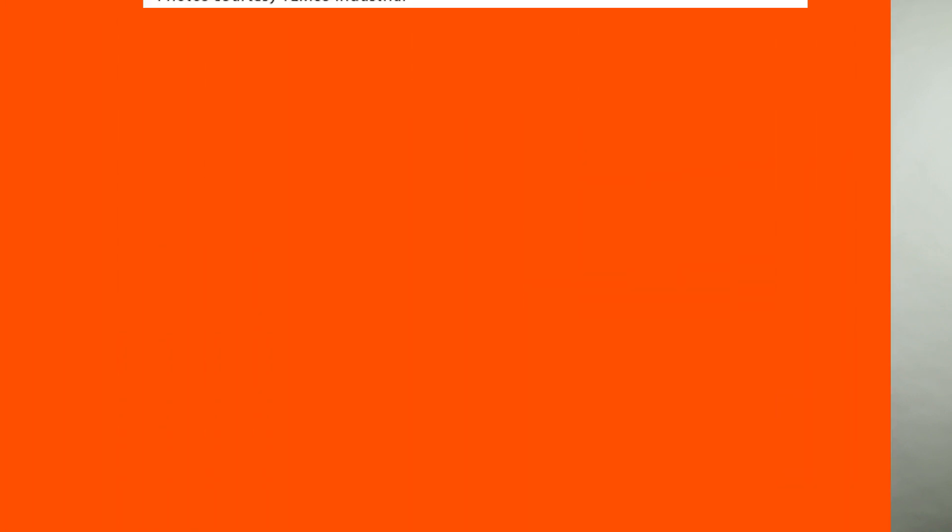Secondly, terminal crimping. Terminal crimps are how you connect a battery wire to a battery or to an inverter or charger. It's very important to pay attention to the type of wire you're using, the type of crimp, and the type of crimp tool you are using to make those crimps. Always make sure you don't over or under crimp your battery terminal wires. Under crimping makes a terminal that is not connected well and is subject to becoming loose or causing a short, while over crimping lessens the structural integrity of the wire itself and may break apart due to stress over time. A good crimp will feel solid without pinching or stressing the wire itself.